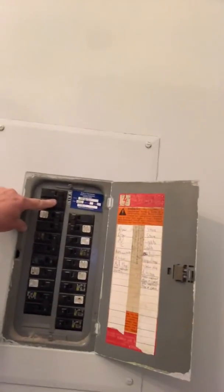Subsequently there wasn't much to look at because the access was tough. So we're gonna take a look here at a water heater. Well, let's just take a look at the bathroom, the whole bathroom. All right, so right off the bat, what we notice here, we've got an electrical panel. This is our main panel. The main panel is 100 amp main. Outside on the meter, it says 200 amp. Not the case. The meter box itself, just from a sizing standpoint, is only a 60. So it's very, very small. So we need that service updated, number one.